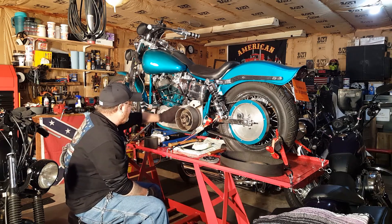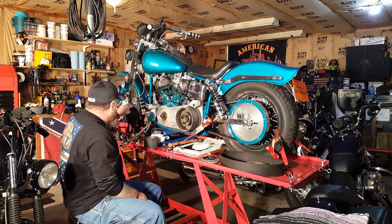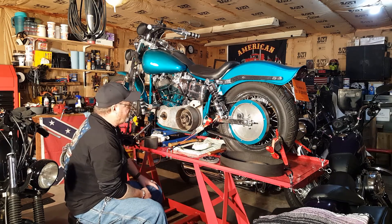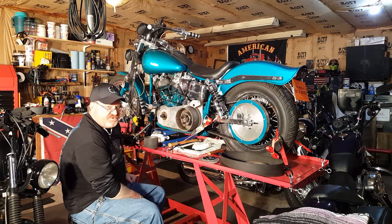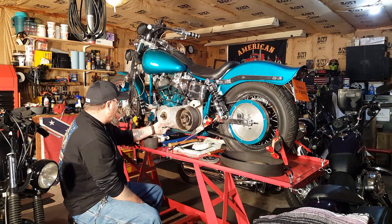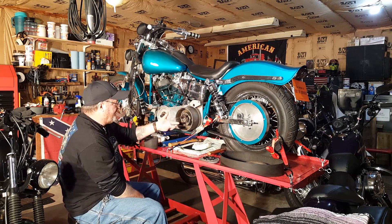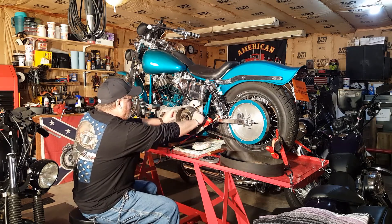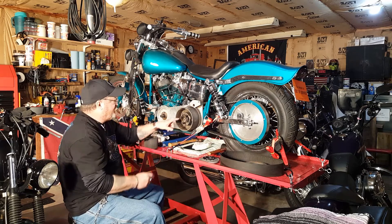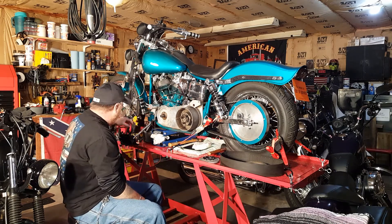I'm going to go ahead and take this plate completely off and probably put a motor plate on, put a spacer plate on, and get rid of that backing plate because it's hard to service. You just can't get through — you've got to try to come in through the other side, and it's just a service nightmare. With just a motor plate and what they call a bearing bracket — a thin piece of aluminum that bolts in with a bearing in it — that allows this to sit and ride without putting any stress on the output shaft.